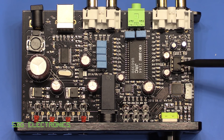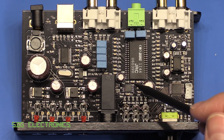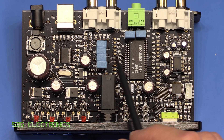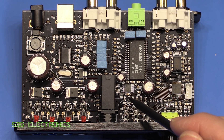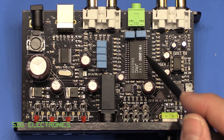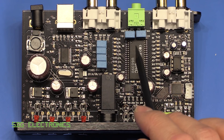There's an output buffer and filter op-amp, and interestingly it's in a DIP socket, so you can swap it out. Currently it's an NE5532, but you can replace it with something more exotic if you wish. An STM8 8-bit microcontroller handles all the housekeeping: reading the rotary encoder, driving the LEDs, detecting button presses, and interfacing with the NJW1144. The PCM2704 and MAX headphone amplifier need no digital configuration.